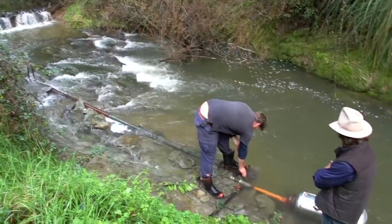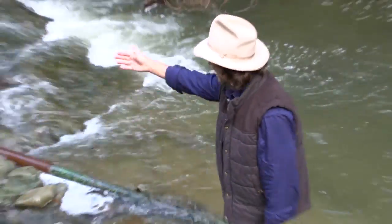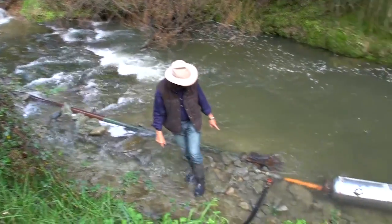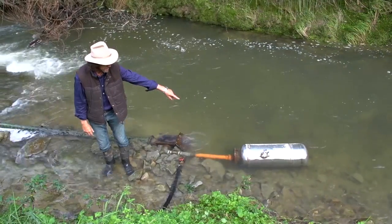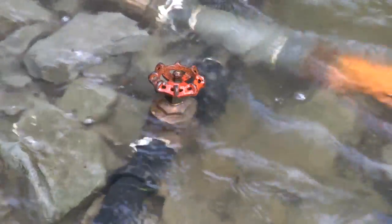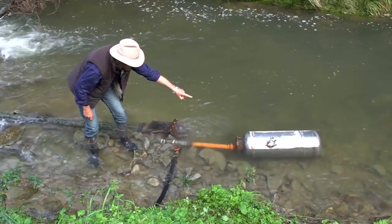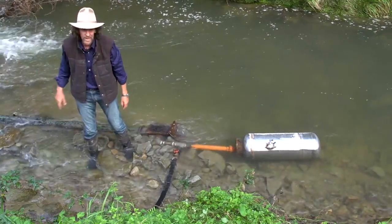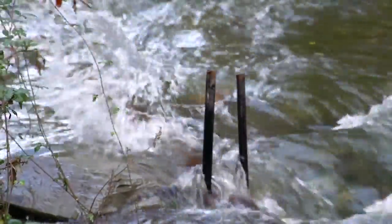The back pressure against that compressed air captured in the chamber releases water up a smaller diameter pipe. What we've got is the water coming down from just above the little barrage dam built out of gabions, like a weir. The water's coming down the pipe and hitting into the cylinder, which has a car inner tube in it, full of air at 70-pound pressure. The back pressure against air is shutting back the flapper valve, which can send water up the lift pipe. Water coming down gets to a point where the back pressure off that inner tube inside the cylinder shuts the flapper valve and sends a residual pump that way. At the same time, a shockwave goes back up the line. You can see the shockwave come out just there because there's a hole in the feed pipe. If you look just above those two-star pickets, you can see a pulse of water.